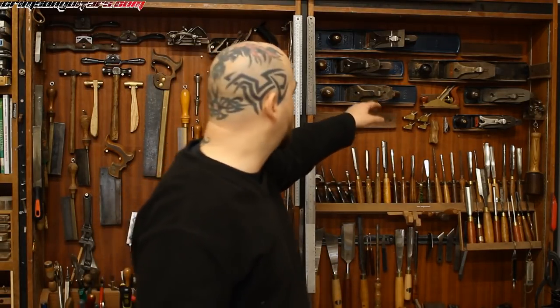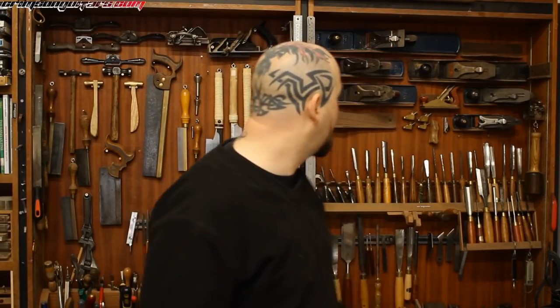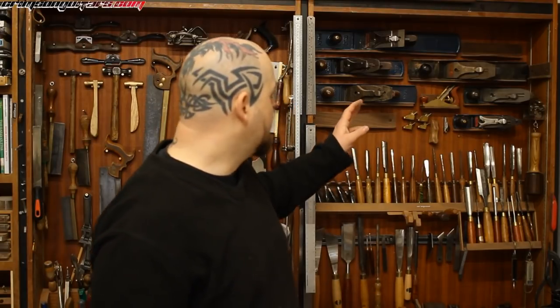Like Crimson Guitars — our range of luthier's tools — boutique level and all that. So I went from saying you cannot beat an old record plane, to saying the steel isn't quite that good. I've done a video putting a Hock blade into my number seven, and actually the Hock blade is an upgrade. I've got some Clifton blades that I'm going to put into other tools on video. The Clifton are forged, properly beaten and forged. The Hock blades are cut from steel, and Hock has been recorded as saying that if he had the money and time, he would prefer to forge his blades the way Clifton does. So I've gone from saying you cannot beat an old tool to saying you can upgrade an old tool.